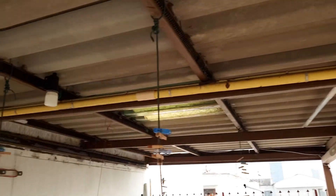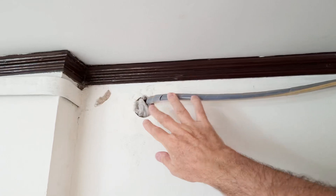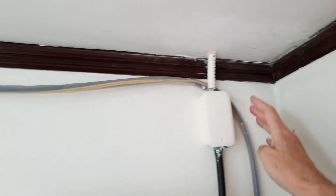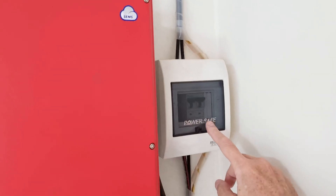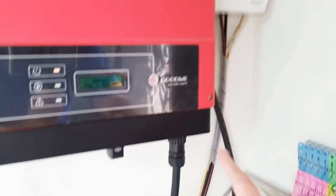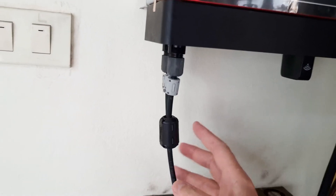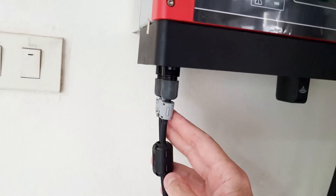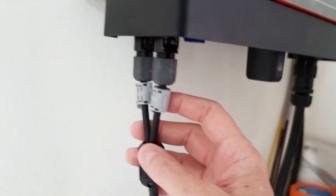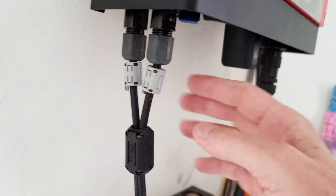Let me show you what I've done about it. Here's where that wire comes into the house, comes down over here through the DC breaker right there, flows down underneath and back up — and these are the inputs to the inverter right there. The first thing I did was get two RFI filters and snap them on the individual leads.